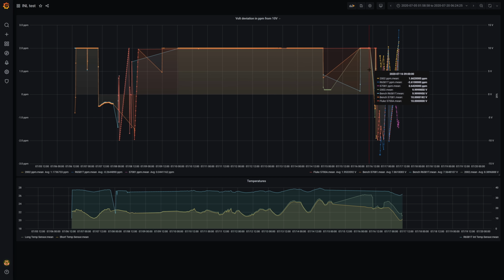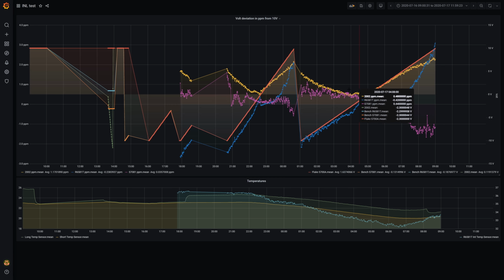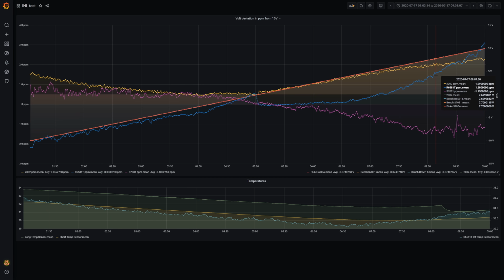My simple linearity tests, featuring 3 voltmeters and 3 thermometers, are really just scratching the surface of what's possible with Grafana. But hey, it's a huge improvement and a lot more insightful than the time-lapse, isn't it? I can use math operations in the database queries to turn the absolute voltage readings that are stored there into ppm deviations, for example. This reveals a number of things.